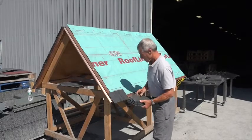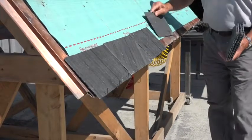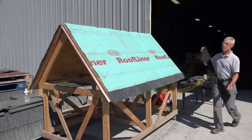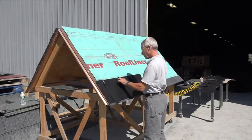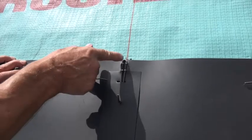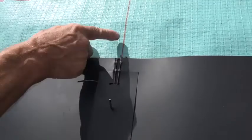Place the underneath slates or starter course in the hooks of the Slate Shield copper clad drip edge from left to right, or nail the starter course depending upon your application. Place the first trim Slate Shield panel over the starter course, aligning the panel's top edge with the first horizontal chalk line at 14 inches. Ensure that the vertical chalk lines are always aligned with the right-hand hook side of the butterfly hook and not centered on the eyelet position of the hook.